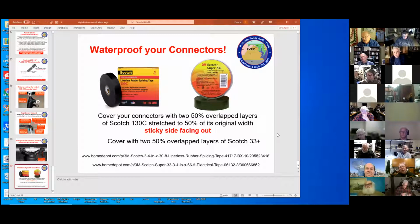Okay, so let me ask you a question. How important is it for you to be able to work E-skip for signals that are only 500 miles away? Not very. I've got a high LFA at 77 feet for that. Okay. So I would suggest that the antenna you've already installed at 40 feet is a pretty good height.